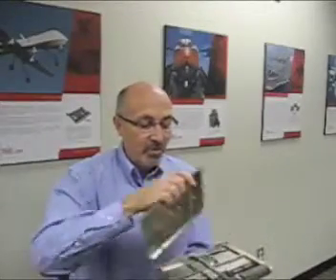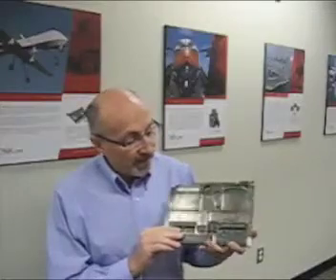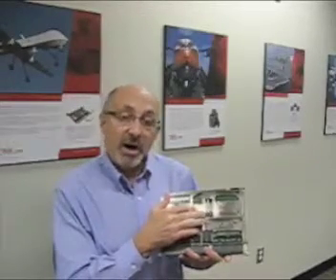What I'd like to talk to you about now is a feature that comes with the 185 — specifically the fact that we create what we call line-replaceable modules. That is a Vita 48-style card, which has front and rear covers. The covers allow you to create a line-replaceable module that allows you to use and replace a card within the field. One thing I'd like to point out on the 185 is our patented heat pipe technology. The heat pipes allow us to take the power out of the processor and distribute the power to either card edge, allowing the card to function in any orientation.